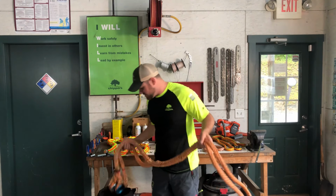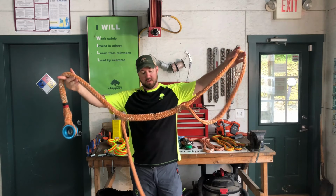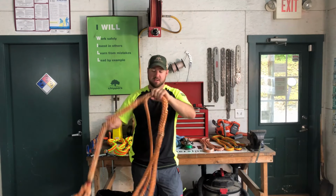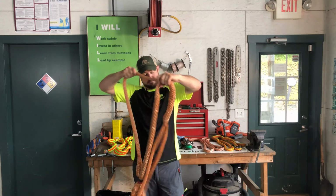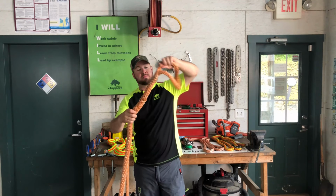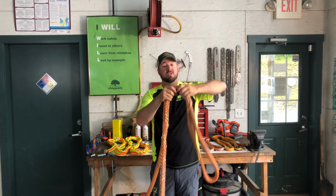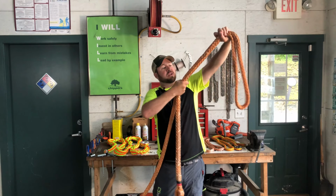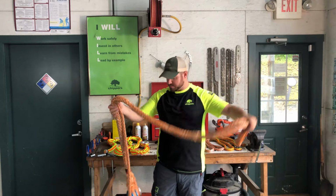We also have slings like this one here. It's a whoopee sling, okay? It uses a Chinese finger trap to hold tension. So you pull on one end. As you can see, the sling gets smaller, or you can adjust it back the other way by pulling in the opposite direction. And once you get the desired direction and length that you wish, all you do is stretch the fibers out, and it acts as a Chinese finger trap that doesn't allow it to move.